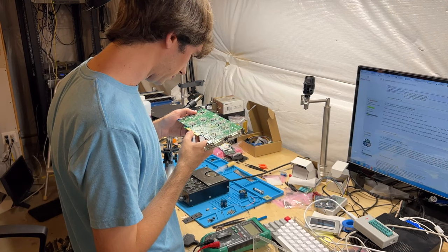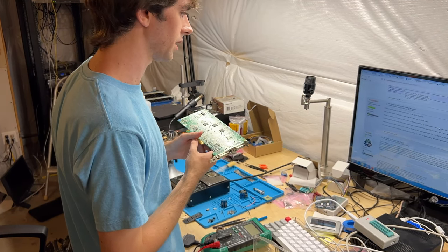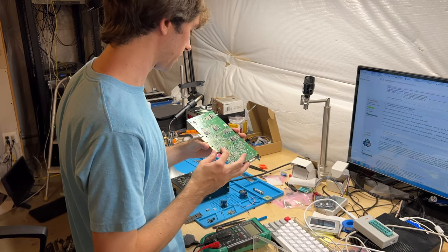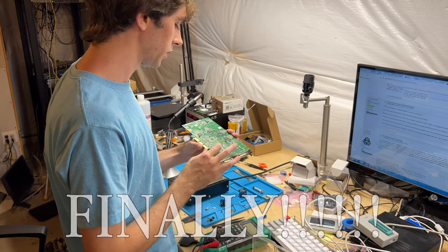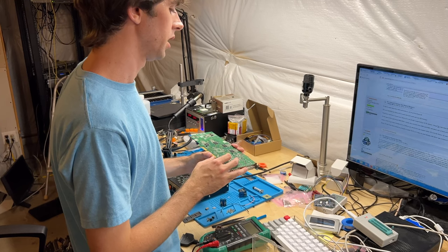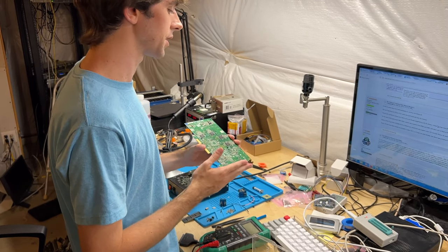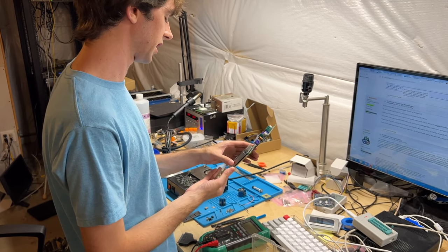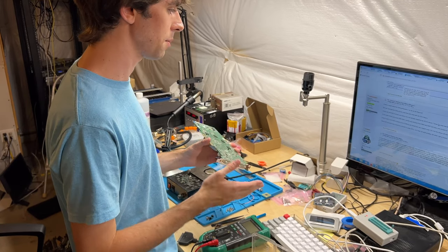Okay, Collin, so what did we figure out? I read through this forum a little bit more, and according to this, you can set some resistor configurations on the board to actually change the device ID of the card to a GeForce 4 Ti4600. So in theory, the driver should be happy with that, because I don't think the drivers in OS X natively support the Quadro 4, whatever this is, XGL 900. So we'll try that and see if that makes any difference.